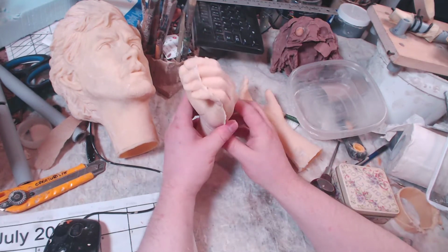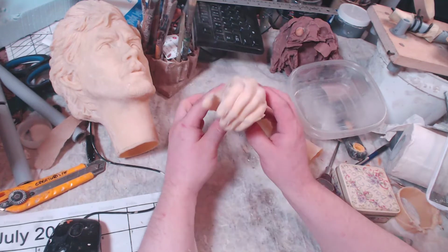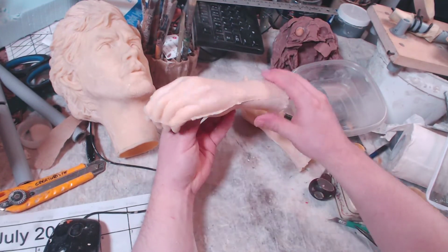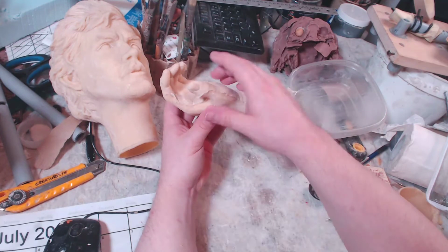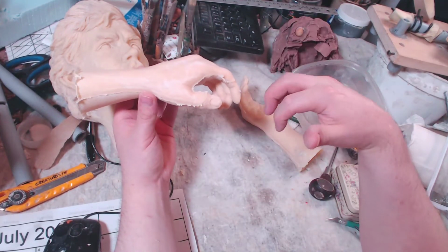And he was right. I actually went a little bit deeper than he said because I figured, the shape I had, because of the curvature of it, I needed to simplify it a little bit more. So the upper part is a much simpler shape inside the mold now, and it pops right out, no problem. The inside is a bit more tricky because these fingers dig into the plaster.